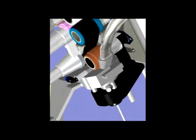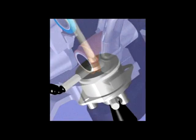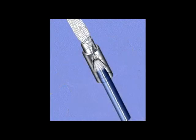Like rotor spinning, there is some degree of random fiber entanglement that is also involved. This is the main reason for the somewhat lower yarn strengths of air jet yarns when compared to their ring spun counterparts.